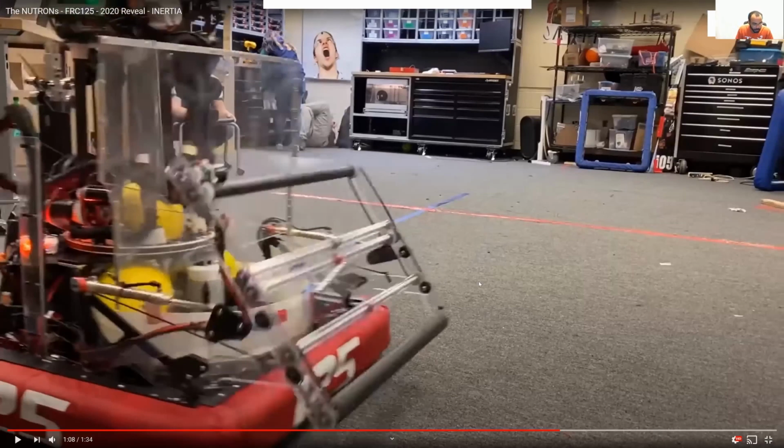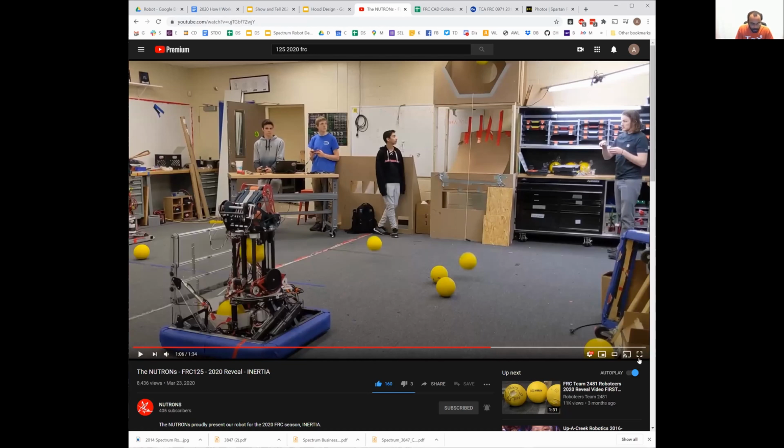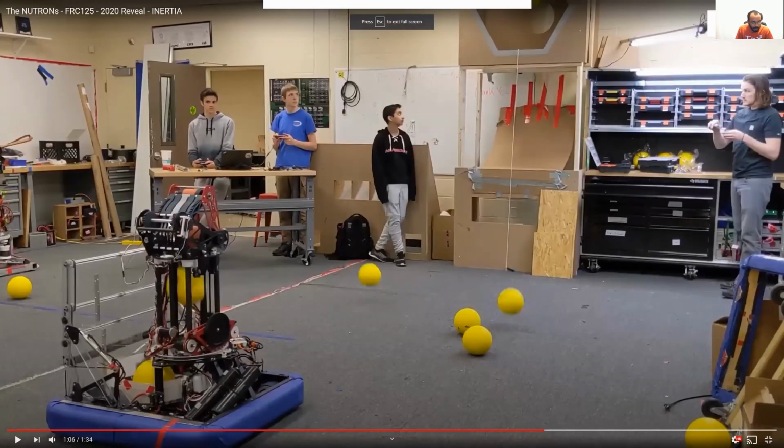One of the other things I've seen, at least from one other team, is instead of just relying on the servo to keep your position while you're shooting, they'll have a pneumatic brake that'll basically push in somewhere into the actual hood itself in relation to the rest of the stationary shooter frame, and kind of lock it into place. So you'd have either something that locked into the gear teeth, or just even a friction plate up against the hood. So you get rid of any of that. You're not worried about the motor holding the position anymore. Once the code has gone through and said, okay, we want to be at this angle, we believe we're at this angle, you deploy some sort of tiny little pneumatic that pushes pressure on it and stops the ball from being able to move it off that angle at all. So that's something we can think about when we're designing it into the system as well.